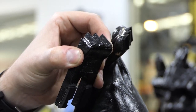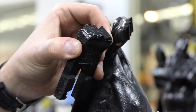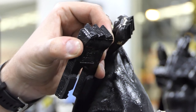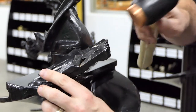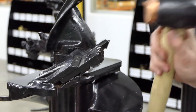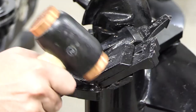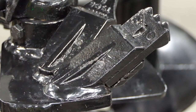Centralise the rubber in the holder. Ensure that the cutting edges on the auger teeth are facing the same way as the pilot, and the rubber pads are facing towards the auger flights. Place new teeth in the pockets and knock the tooth in with a soft head mallet. If a pin lock was put into place initially, replace with a new nylon pin through the top of the pocket, locking the tooth further into place.